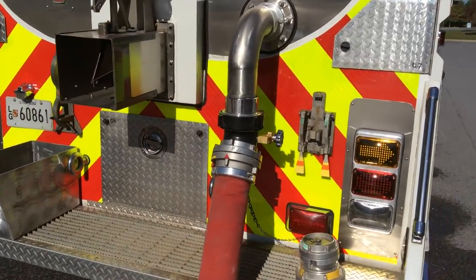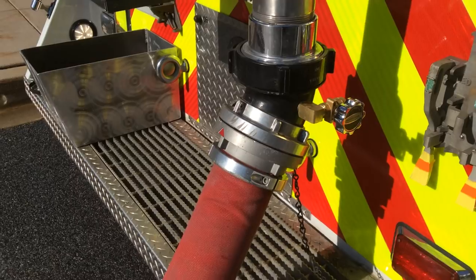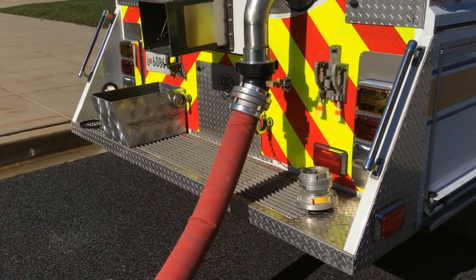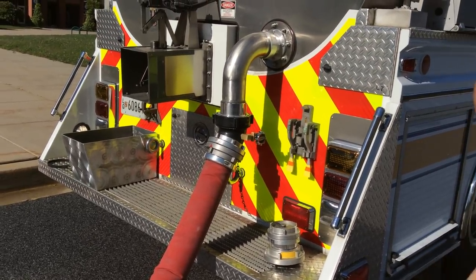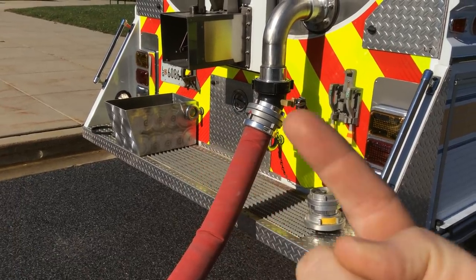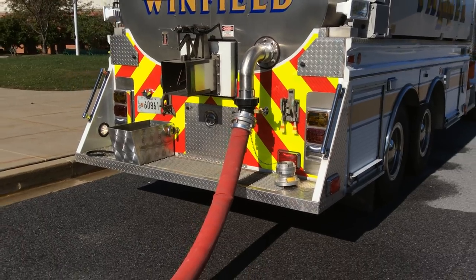There is a drain on it. The drain can be used if you want a cleaner valve. It really hasn't proved that we needed it. What's nice is at the end — if you want to, when you shut the line down, the check valve closes and you can pick the hose up, open the drain, and that way your feet don't get wet. It really works pretty nicely.